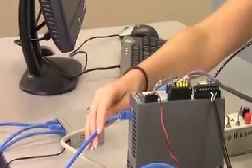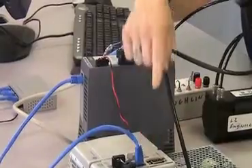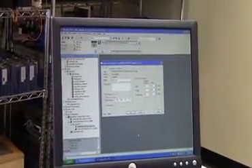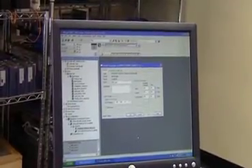It's really quite easy. You have the AKD drive with a Cat5 communication cable plugged into the Ethernet port. The other end is connected to a CompactLogix controller via this switch. You need to make sure they're all on the same page as far as communications, so we've made all the IP addresses on the same subnet. There are a couple of places you would look to confirm this. Once you have the two communicating, then you can initiate programs.